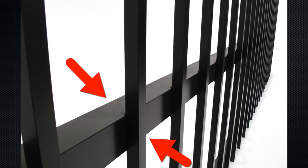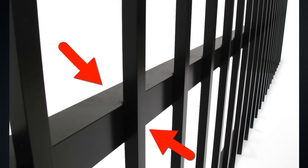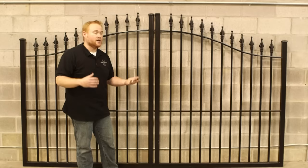Now two reasons that's not a great approach. First of all, it's only going to look good from one side of the gate. You'll have a very smooth rail on the front, but on the back side you're going to have a picket sticking up with a weld mark on it — a strange look from one side versus the other. With a punched rail, the gate looks the same from side to side.